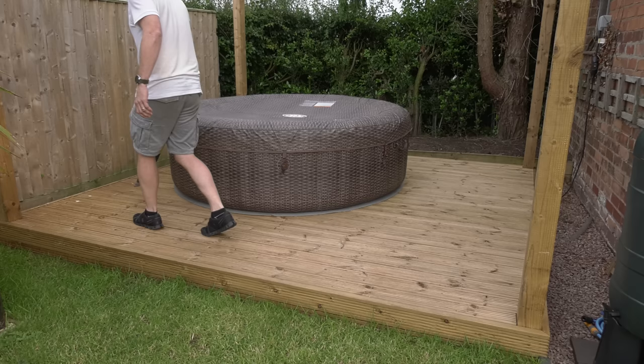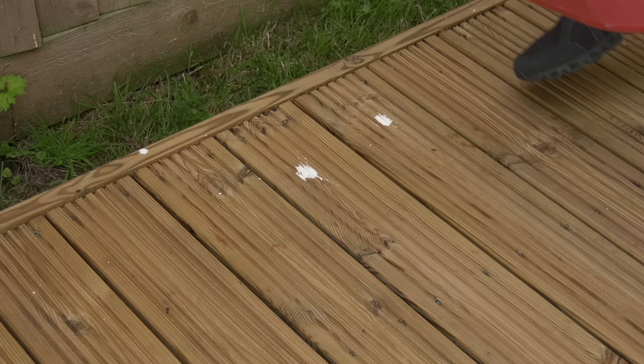A quick final point on ongoing maintenance. Regular sweeping — or in my case generally use of a leaf blower to remove pollen, sap, dirt, bird faeces, etc. — is recommended, because if these things sit on the deck, when it rains you'll have an ideal breeding ground for mould, mildew and other nasties to grow and feed on them. If you can, carry out a yearly clean and revive like I've done, topping up on the oil treatment if necessary.